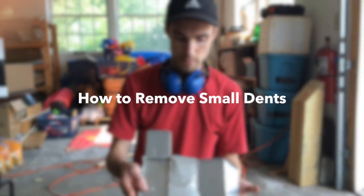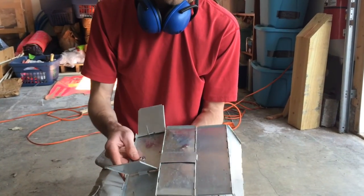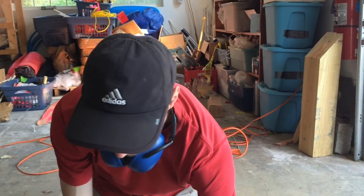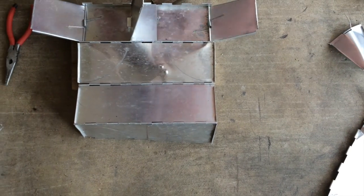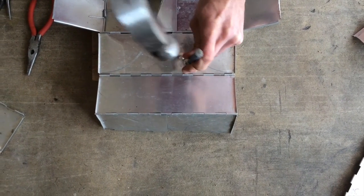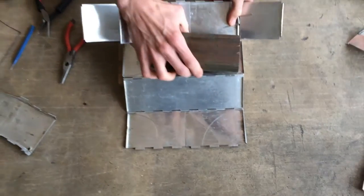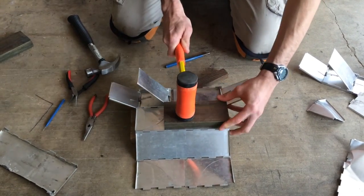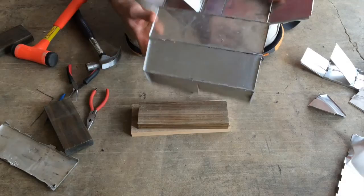In this trap, we already pulled the main pin out and this one's not too bad — it's just got a couple tooth marks and some denting. So I'm not going to take all the panels off; I'm just going to pull that one pin and fix the damage here. I like to put one wood block underneath and then one on top. First I'll get rid of these two dents using the punch, use the block, and take out the creases and straighten some of this out. And that should be good to go.